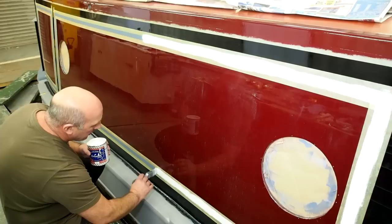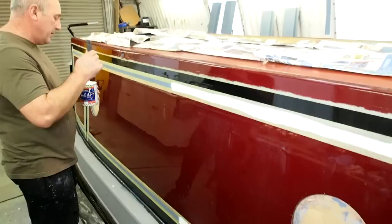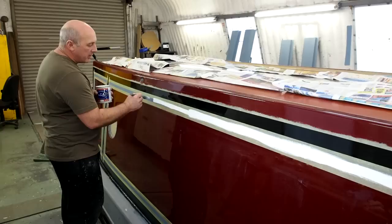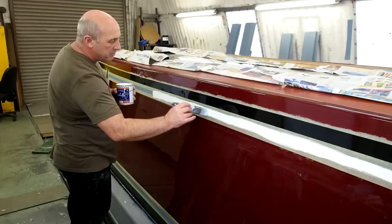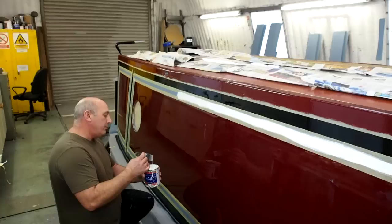The reason I mention this is you often see people paint where at the end of each stroke the brush actually leaves the surface — it gets to the end and they sweep off, then come back on at the other end. You will tend to flip paint and get little flecks shooting in all directions. If you can keep your brush in contact with the surface the whole time, it works the paint in and also stops any flicking action with the brush.